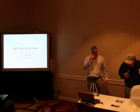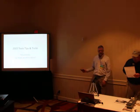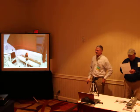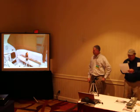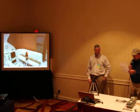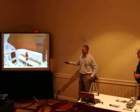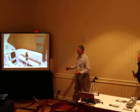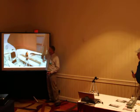Okay, so the first one, which is number 1, is called the Laser Level Material Line Helper. We use this as a laser level to measure and mark our material lines on things like aft curtains or canvasbacks. So basically what this is, it's a construction laser level that sits on a tripod. I imagine they come from Home Depot or some sort of construction home improvement store. It's set up in the cockpit of the boat while they're doing the templating for the aft curtain.